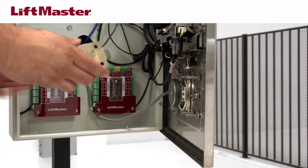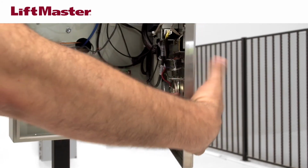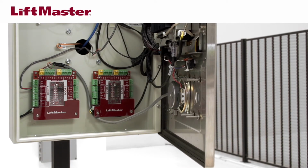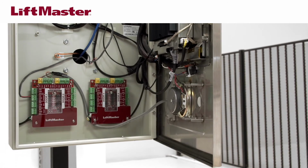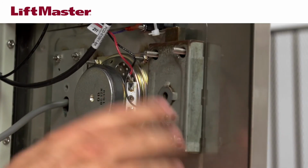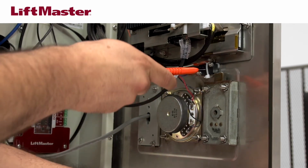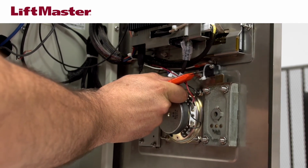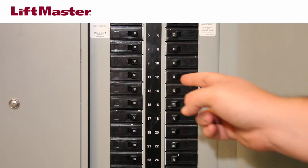An optional postal lock can be supplied by the Postal Service for installation. Remove the wing nut and plug. Discard the wing nut and plug. Remove the 4 mounting nuts from the studs. Install the postal lock using the 4 nuts. Cut the factory-installed wire tie from the postal lock switch. The postal lock switch is wired from the factory. Restore power to the CAPXL and gate operator.